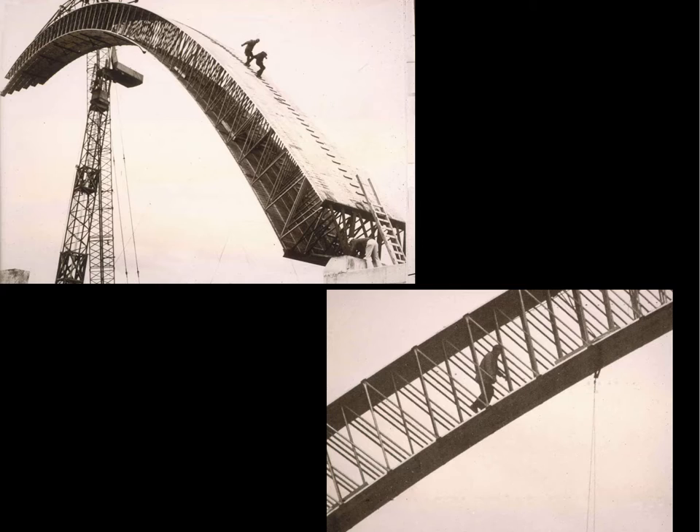The curved sheets of material in this image are monolithic sheets of one-and-a-quarter-inch plywood — monolithic meaning they have all been connected together so they can act in both compression and tension as needed. They are primarily intended to work as compression elements, as arches in this roof structure. Such thin, flimsy sheets at the scale of this building would roll-through buckle immediately, so the top and bottom sheets are laced together with round steel tube web members, turning the roof arch into a deep truss that is very effective in resisting roll-through.